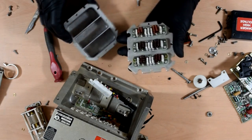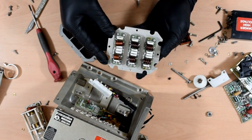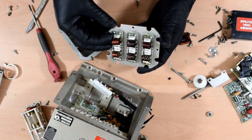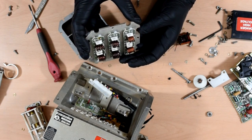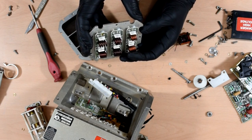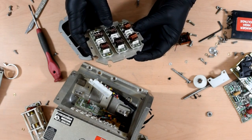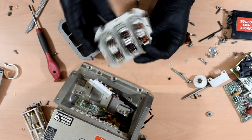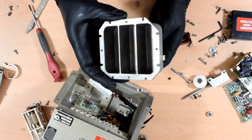Oh, that's nice. So that's a whole collection of filters, and there's some little capacitors there, which don't say the value on them, at least nothing easily recognisable. 510G, 360G, 270G, I guess that's picofarad or something. And some nice big inductors with some Teflon feed-throughs. Very nicely made. Nice little filter casting as well.